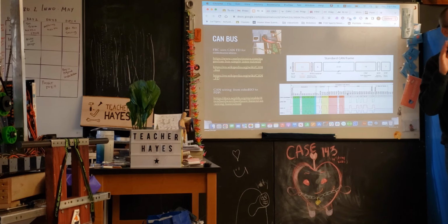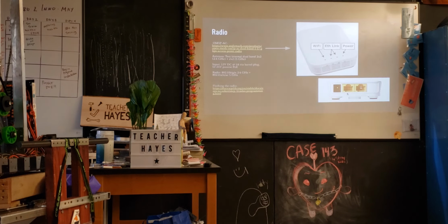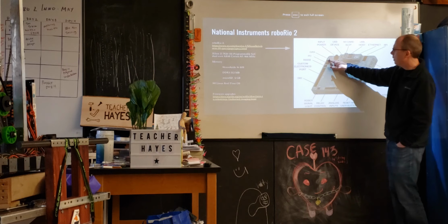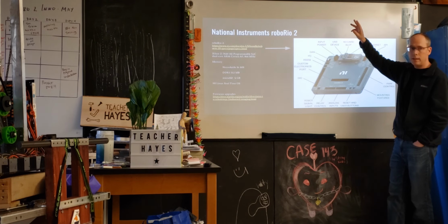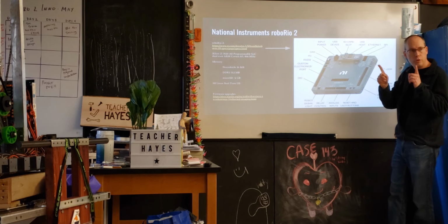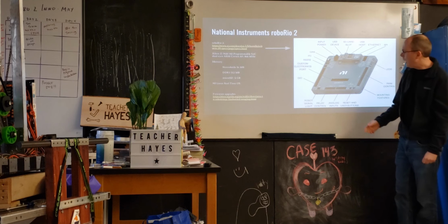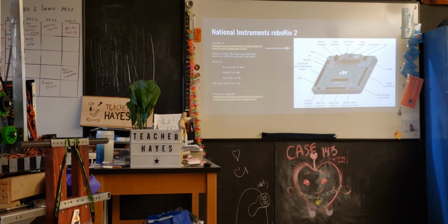In general, just to back up, last year we had a number of devices, and at times we thought our CAN bus might have been overloaded with information. That was one of the reasons why we looked at buying the CANivore, which is basically a device that will run a second CAN bus on the robot. The way that device would work is, one CAN bus is coming through here. That CANivore would go through the USB and then start a different CAN path. So now, as I was talking about before, if you have 10 devices and they're all trying to send information on the same wire, they're all in contention. If you can separate them out to this other USB, then you'd have two parallel tracks. You can get twice as much bandwidth potentially. At the end of the day, you're probably limited by the compute that you also have on the National Instruments. So when you look at some of the debug that you get through the driver station, you'll notice that can happen too. Is that your question? Yes.